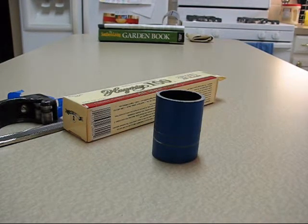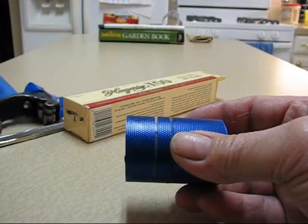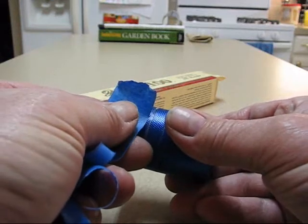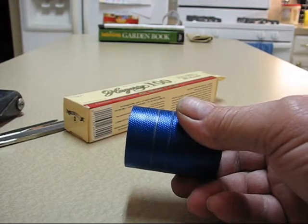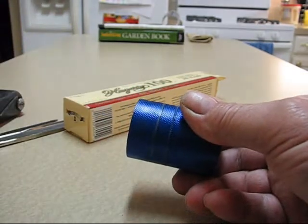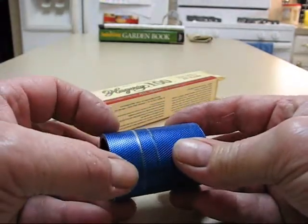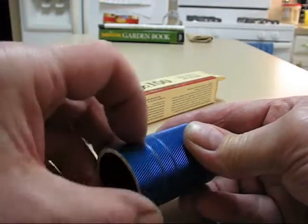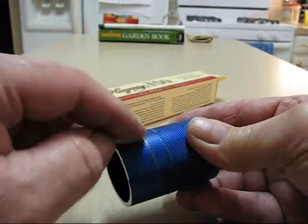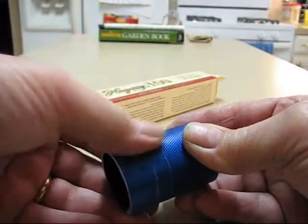One final note: I probably should have said this all along — once you have the channel filed, there's no reason why you can't take masking tape again and go over both edges alongside the channel. When you go to start sanding and using steel wool, I don't think about it anymore because I've done it so much, but I did think about it while looking at the video — it probably would be a problem for people who haven't done this much. You can remove the anno pretty easily. So after filing, when you're ready to smooth things down, run tape along both edges of that seam, and that way you have a better shot at working just in the channel itself rather than hurting anything on the outside.